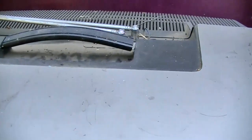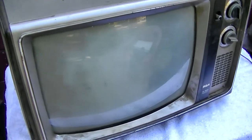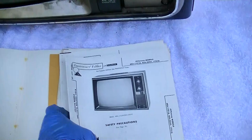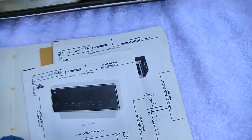This uses SCR horizontal deflection. I don't think I want to bring this up slowly voltage-wise — I don't want to run any risk of the horizontal oscillation not starting. I'm not that familiar with this deflection setup. I just know that they're extremely difficult to fix when they fail. I'll do my best to go over how to use a converter box to get a signal to this old TV in this video.